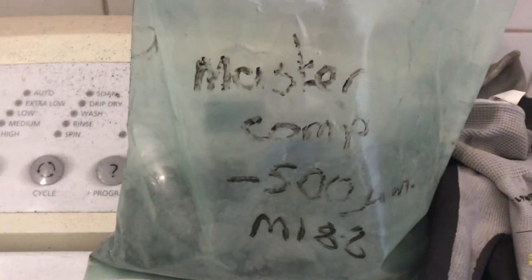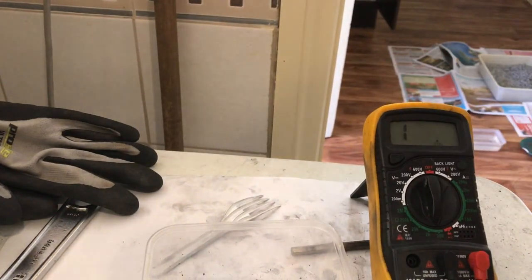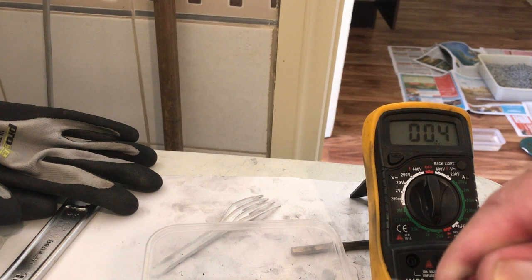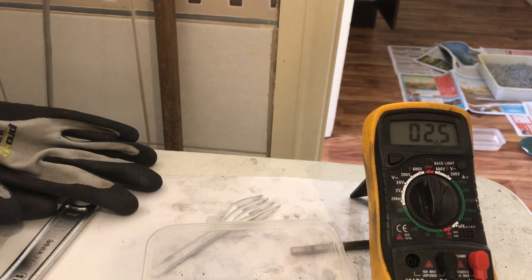For the processed version of that 500 micron sample — you can still see some impurities in it. On the 200 ohm range, it started off at 5.5 ohms resistance unprocessed and we've brought it down to 1.3 ohms. Bridging to the meter we get about 3 to 4 ohms. So we've got the best results on that format of graphite — 1.3 ohms resistance.